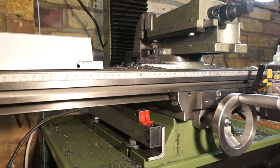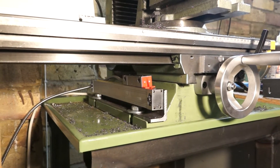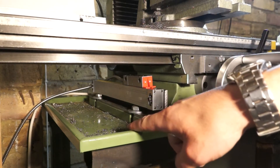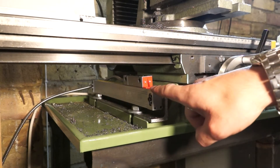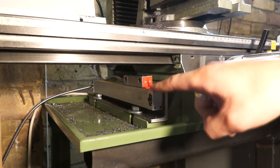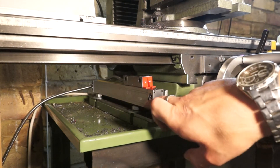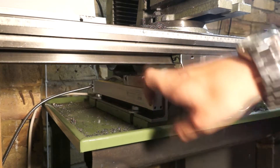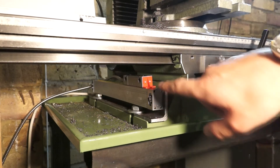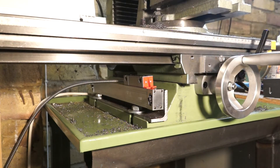To give you a bit of orientation, here we are at the front lower side of the mill. Down here is the first bit that I've made. On the bottom edge there's just a bit of right angle bracket that I've cut the front edge off, just so it doesn't overhang too much. That runs all the way down to the end, the same length. I've measured and cut the slots for the bolt holes - there's one there, one at the back. These washers I've had to put a flat spot on the back so they don't interfere with this edge. I've then got some mounting holes that go through here, and because these are slots, they are height adjustable. That's this bit fully mounted up. Then I've got the actual slide bit here that moves as this table moves back and forth.